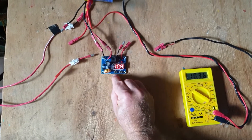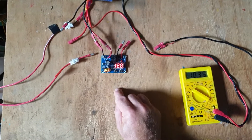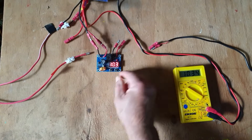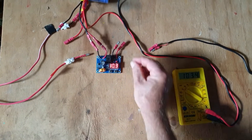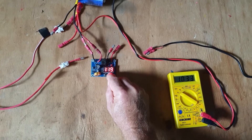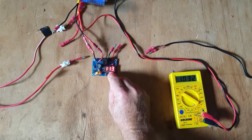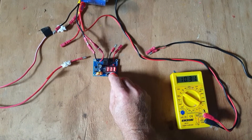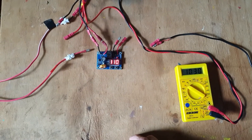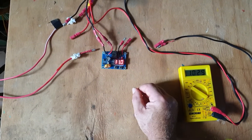I'm going to change those. The first one I'll change is the 12 volt setting. I'm going to double click the plus button, and you'll see that the little decimal place starts flashing so I can adjust it while it's flashing. I'm going to change it down to 11 volts. Now when I press it, I've got 11 volts.